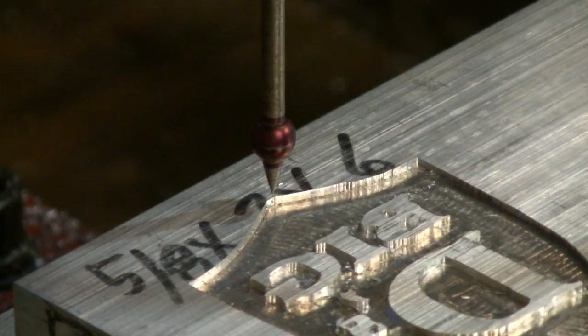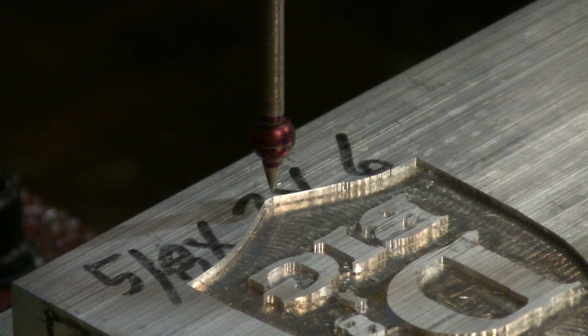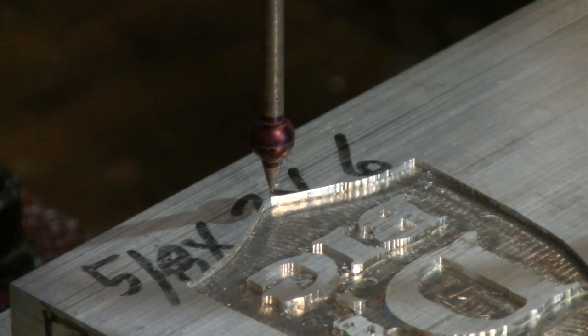Aside from using the wiggler to find the corner, as you might have seen in one of the other videos on the mill, I was losing my XY position and had to actually pick up a new point. It's a great tool for this because I was able to zero in on a sharp corner — another place in the part that had already been cut — and it enabled me to salvage the part. I ended up creating a new work coordinate system that I could zero off of what's already cut.